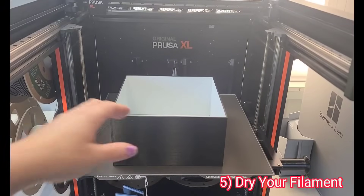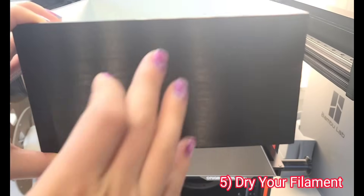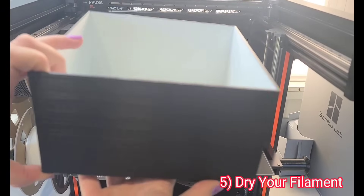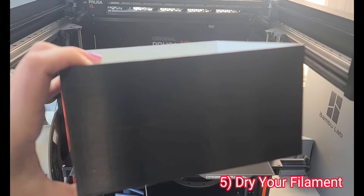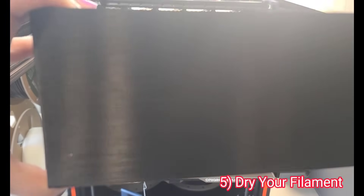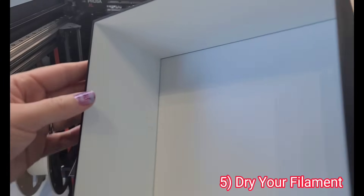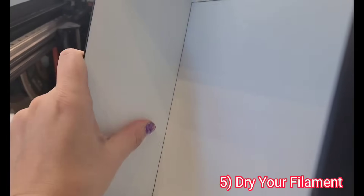I then tested a black-and-white room box print — black on the outside, white on the inside — all in one print. I ran it without dried filament using the same spools that were spotty on the Benchy, and it turned out really good. There's just one tiny spot of white visible on the base. My rule of thumb going forward: for large prints, drying filament is less critical, but for small or highly detailed prints, I need to dry the filament. It takes about 12 hours in the Bambu dryer, so I'd rather not do it for every spool.